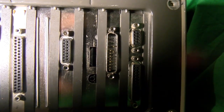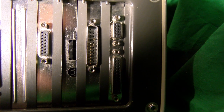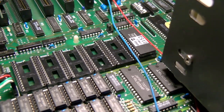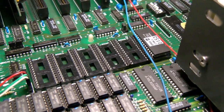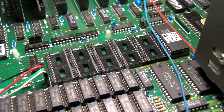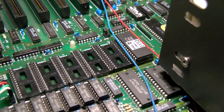In any case, we were talking about interrupts, and at most we probably have 3 IRQs free in most systems, but IRQ 3 and 4 are generally assumed to be COM ports, so we can't necessarily use them for other peripherals. It sucks, but assumptions are kind of good sometimes. Again, we're going to come back to this.